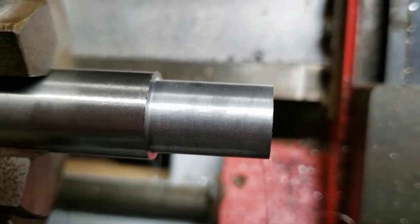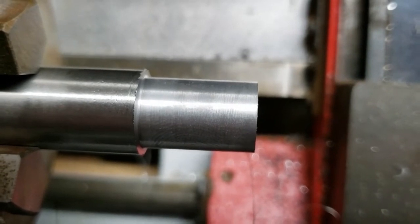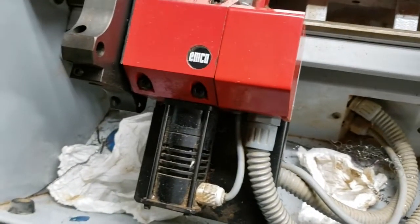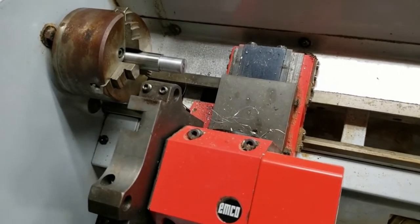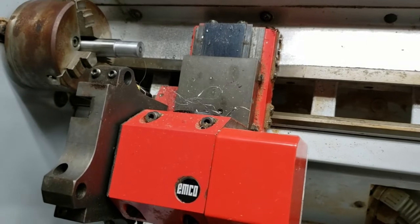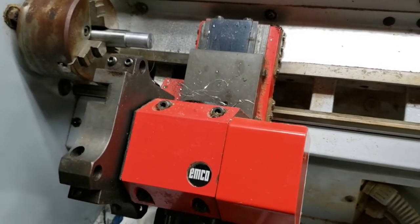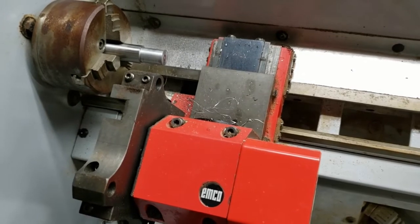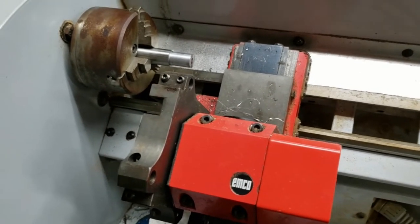I've been taking some skim cuts and testing the diameter — the diameter I cut isn't tapered, but it's not the right size. I'll need to dial in my X-axis and Z-axis travel to the screws I have, and dial out the backlash. When I do that I'll maybe use my other camera. That's all for now — please like and subscribe and we'll see you soon.